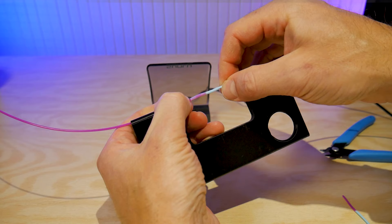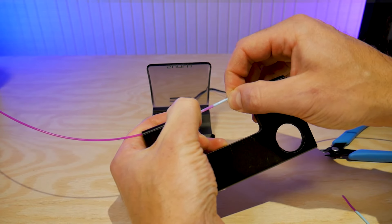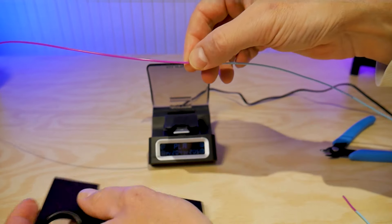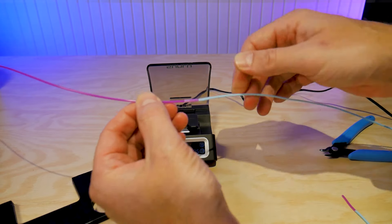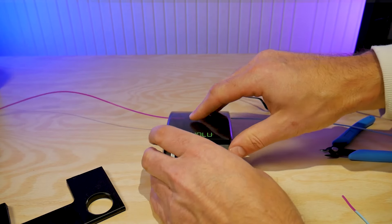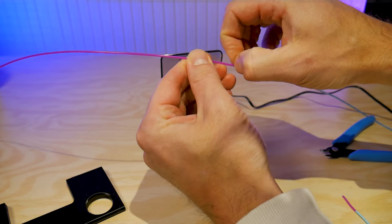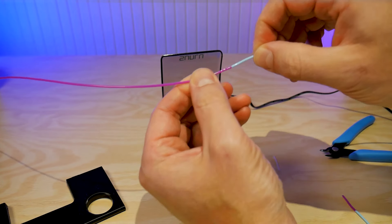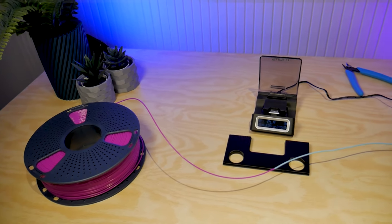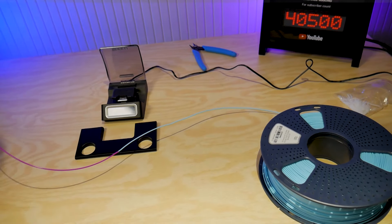It's still a little annoying that the covers on the filament connector are not spring-loaded — they just fall down — but at least you can deal with that with your free hand. While the filament is heating up you can push the two ends together. The tool acts like a guide and pushes the two ends straight. When you pull it out of the machine the tool is still holding it together nicely, giving you room to grab the filament near the joint and continue to lightly push it together while it cools. Using this tool I was able to get a successful connection on my first try. The joint successfully passed the pull and wiggle test. I've made this printable tool free for download — check the link below.